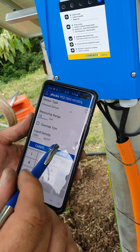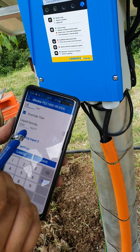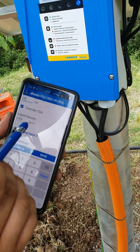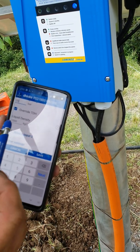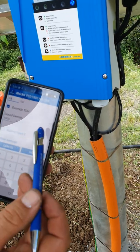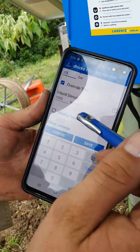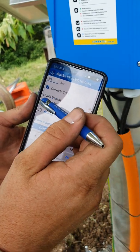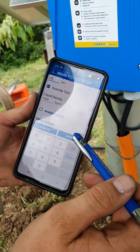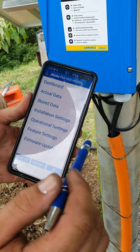Override TDH at 1000 kilograms per cubic meter — that's if we're pumping water. If we're pumping oil, that weight measurement would be different. But we'll leave it on 1000 kilograms per cube: a ton of water equals a cube of water. Click Save.